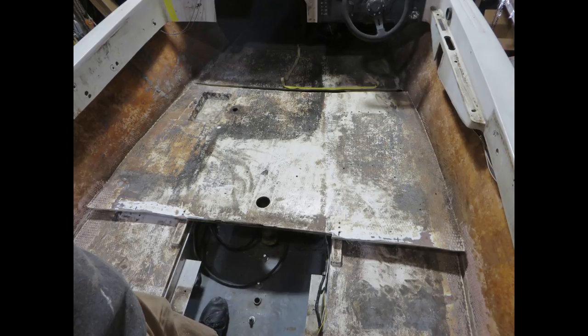Before I cut away that midsection floor, I reinstalled the port and starboard midsection floors back into the boat. There are a couple of ways you can do this — you can use a filled resin slurry solution, but in this case we chose to use 3M 5200 caulk. A heavy bead of caulk on top of the stringers before you set the floors back in, after the stringer tops and the bottom side of the floors have been ground clean. That 3M caulk will bite just as tenacious as any resin, if not better.